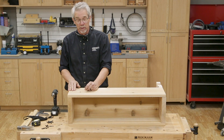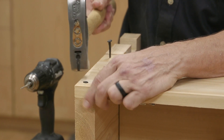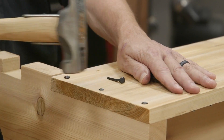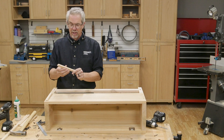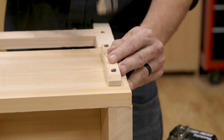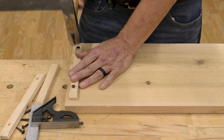Now it's time to put the pieces together. I mostly nailed this bench together using these really cool steel nails from Rockler, which give the piece a bit of a rustic look. In the front, I used both screws and nails, hiding the screws with the cleats. These cleats are both functional and aesthetic — they make the bench look better, kind of old-fashioned, and they help keep these wide panels from warping.